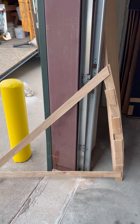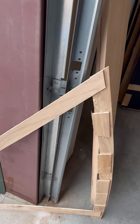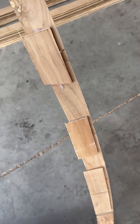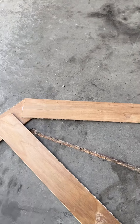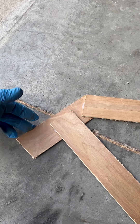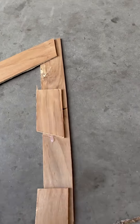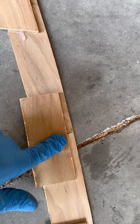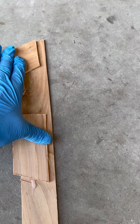Here's an example of one of the templates that I'm making. It's basically a Luan or Dorskin type material. When I templated on the tread, this piece is butted against the riser, and this piece actually has a slight curve to it, and this one side has a more dramatic curve. To keep it simple, I cut it into little breaks approximately matching the curve, and I just took a multi-tool and arched these sides a little bit until they fit tight against the wall.